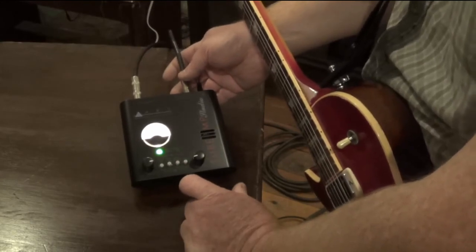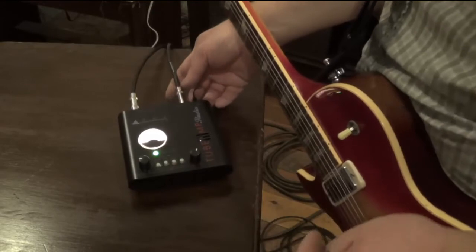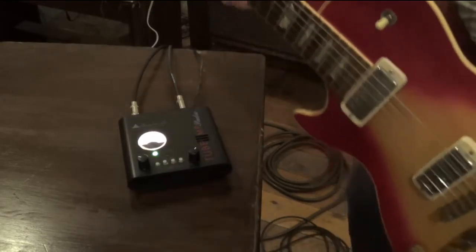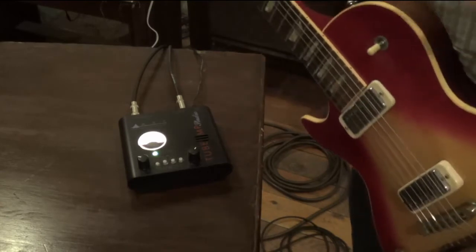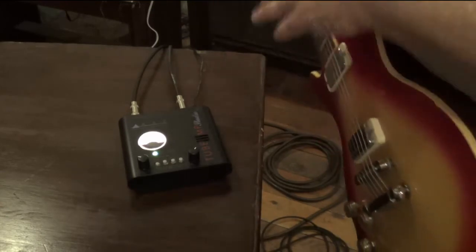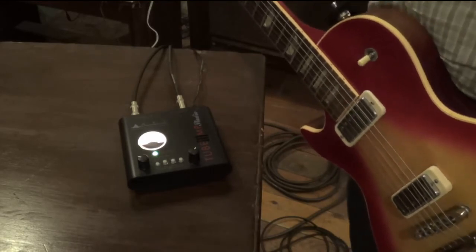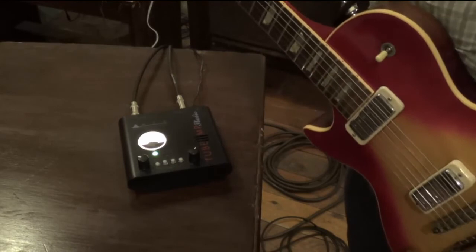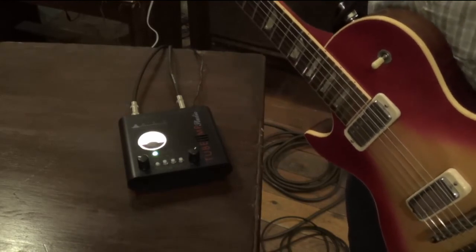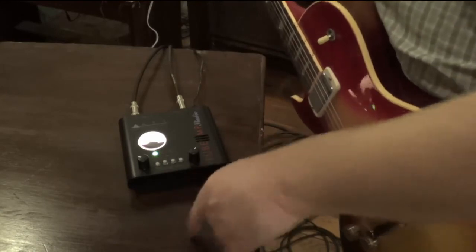So it's more versatile than the old vintage preamps. Plus you can use any preamp you like with this controller and the system. You can use the preamp out on a guitar amp, some sorts of pedals, or those modern preamp units — as long as you can get some good gain to make up for that first gain stage that the Leslie doesn't have, you're going to be in good shape.